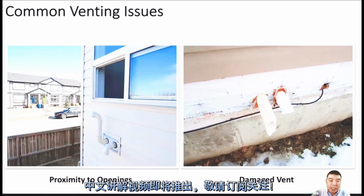Normally, like we saw in the tables before, for the exhaust and the intake, at most 8 inches is enough. So you don't need 24 inches, in fact. I don't know where you saw that, but we can talk about that later if you want. Normally, you just see the manual. The manual will tell you how to run the pipe outside the building. So you just run it like that and it's okay.